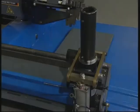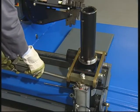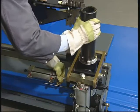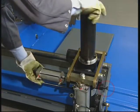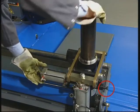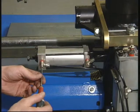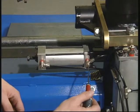When mounting, ensure that the arm pin is in the same position as during demounting. This simplifies positioning. If the pin is not correctly positioned in its seat, the limit switch must be adjusted with the adjusters provided. Tighten the locking nuts. The rotation speed of the tool group is adjusted with two adjusters on the cylinder.